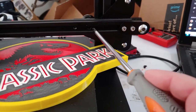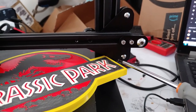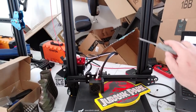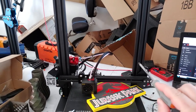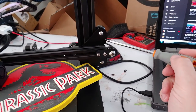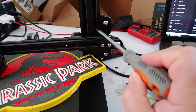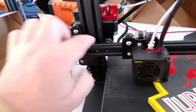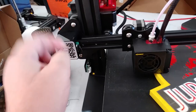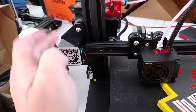Let me describe it better. This is slightly exaggerated, but basically: this is your vertical rail, these are your three wheels. These two wheels need to be parallel — the line drawn between those bolt holes needs to be parallel to the rail. What I found is that one bolt hole is slightly too far out, or the holes that bolt the plate to the rail are not aligned. Either the wheel-side holes or the plate-mounting holes are not parallel to their appropriate rail. I already checked — the distance between the rails is perfect, so the frame construction is fine.